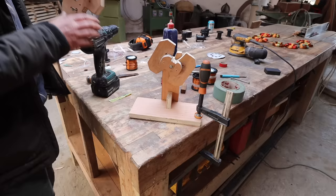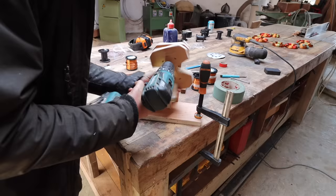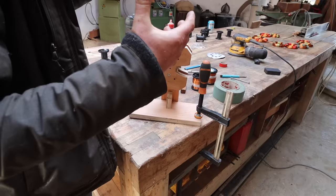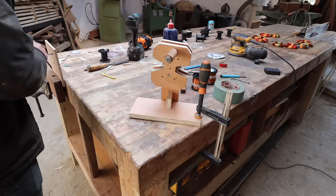And I've got big magnets, so that's why the hole in the middle is so large. And everything interacts with each other, so if you've got big magnets you need to have a big hole in the centre of the coils, and if you've got a big hole in the centre of the coils then the outside of the coil is going to be big, so then the rotor gets big. Because it's all got big, the distance between the magnets, the air gap, gets bigger, so the voltage drops, and you need more turns to account for that, or more coils, and then it gets bigger, and everything is a trade-off with everything else, as it is with these things often.